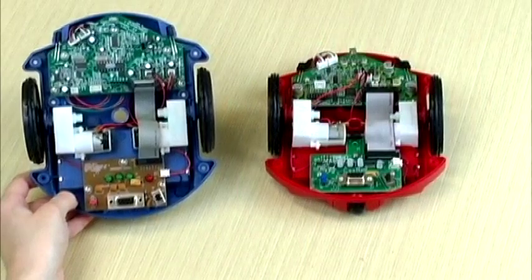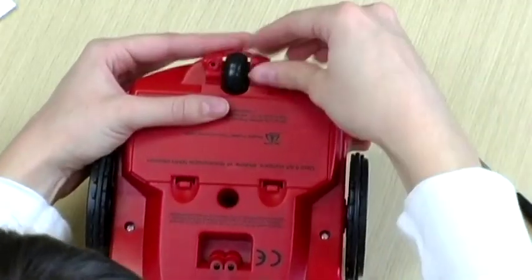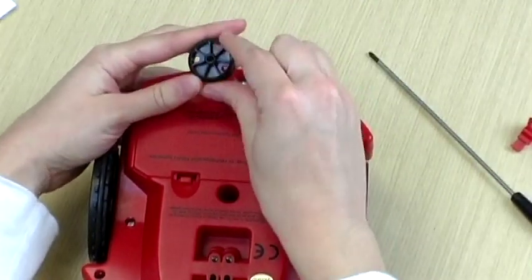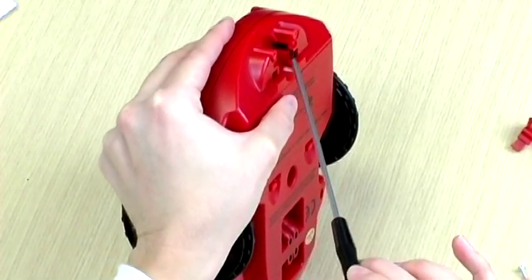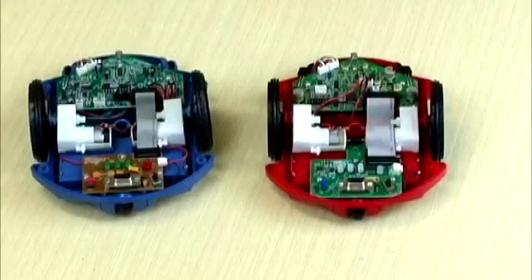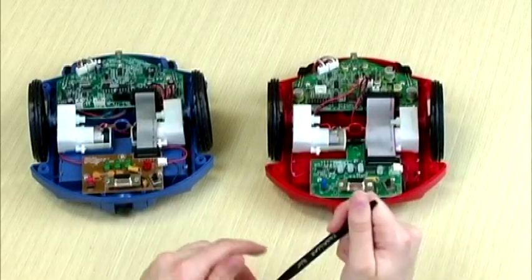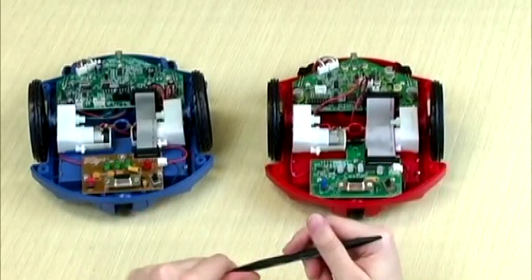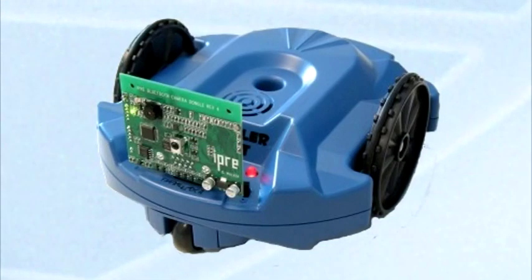As for the upgraded stall sensor, that's right here in the tailwheel. If you take a look at the tailwheel, you'll see there are holes in it. The S2 has an IR LED on one side of this casing and an IR photodiode on the other side, which allows it to track movement of the tailwheel. You may also notice that both robots have serial ports, and you may wonder why the S2 wasn't updated to USB. Basically, the Scribbler had already been adopted in classrooms that require that DB9 connection, most notably the IPRE Fluke from Georgia Tech, so we decided to stick with it on the S2.